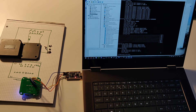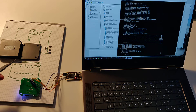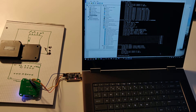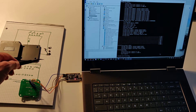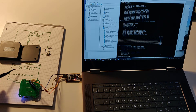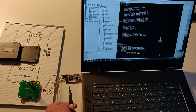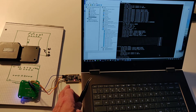You need to disassemble the box. There are just four screws on the back — you need to take off the rubber feet, and behind the rubber feet are four tiny little Phillips screws you need to undo. In front of you I've got the actual pin connections that I'm going to use to connect to this converter here. It's 3 volts, receive, transmit, ground — so you need four pins to connect your programmer, which converts from serial through these pins to this device.